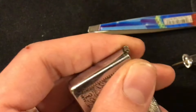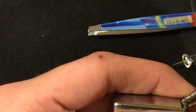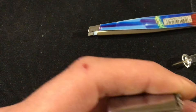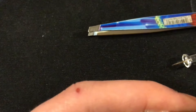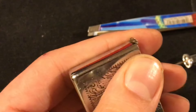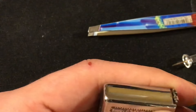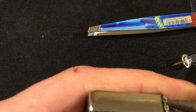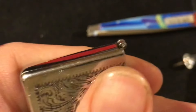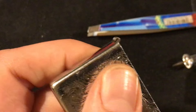Just give it a squeeze, tighten it right around the pin, then go to the next one and do the same — tighten it and bend it back a bit because you want it to curl back around the hinge pin. There we go. Now that pin is in there tightly. You'll have to pull it back out — it'll come back out if you do it right. See, mine slips through, but now the rings are not as far apart and they perfectly fit around the pin.